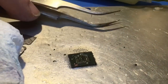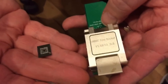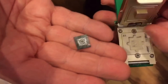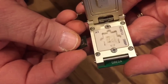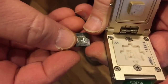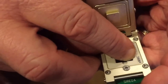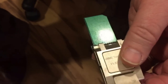We're going to try this chip in a fixture and see if it works. We've cleaned up the chip and are going to try it in our fixture now. This is a fixture made by a company called Serata from China — an EMMC test socket, 11.5 by 13, especially for the EMMC chip. It will fit the pattern we have here. Watch the orientation — there's a little alignment pin. Match that up to this chip to get the right side. It gets in there good and firm. Once inserted, the little pins in the bottom will make contact with the pins needed to read the chip.